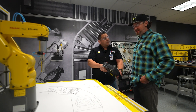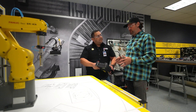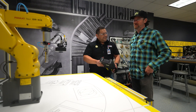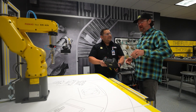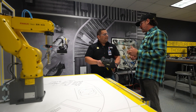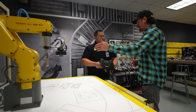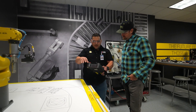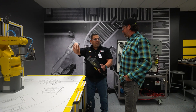Is the process basically — you manually tell the robot what to do, you put the thing out, manually tell the robot what to do, and then you save that motion as a program? Yes. And then in the field, they would do that, and there would be software that controls — hey, for 24 hours you're running program number one, for the next 12 hours you run program two, we're sorting pills, we're sorting soda. Once you program it and it's online, you can be at home saying, I'm just checking that the robot's still running and there's no red flags.